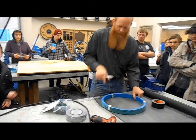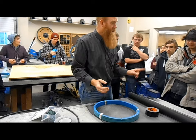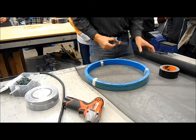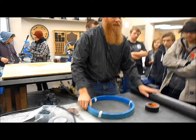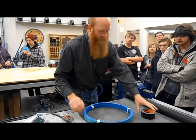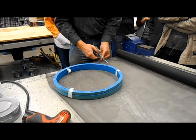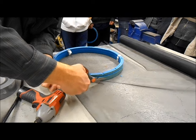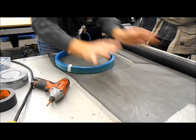The next step: you've got your holes drilled, you've got your pieces cut, you've got the countersink done on everything. The next step is to get the piece of screen cut that's going to fit yours. We have two different sized pipes, so you're going to cut a piece of screen to fit yours. When you cut the screen, leave yourself about an inch all the way around — leave yourself a little bit extra. And cut it off in a corner — don't take your ring and put it in the middle of the screen and cut it out of the middle, because this stuff's expensive. I had to buy over $100 worth of screen for this class. So make sure you do it right on the edge and don't waste any. Just with scissors you can cut this stuff — it cuts really easy. The next person will do it right there with one of the small rings, so we'll utilize it all nicely.